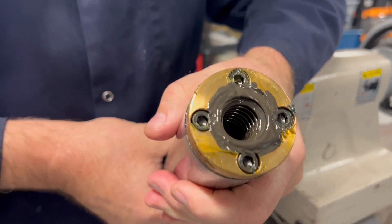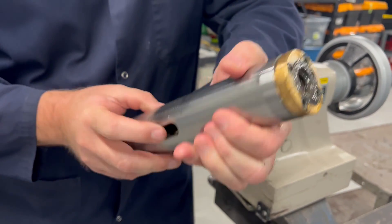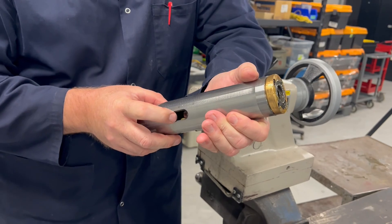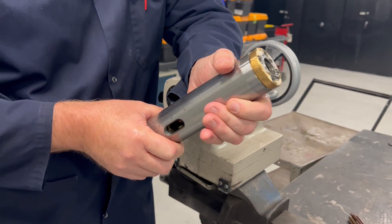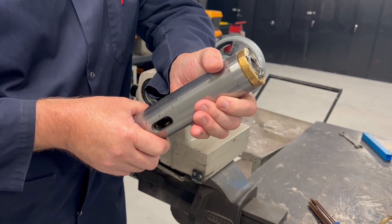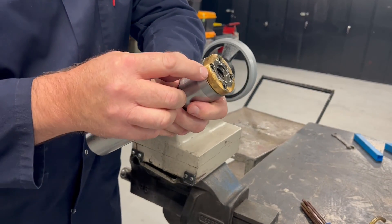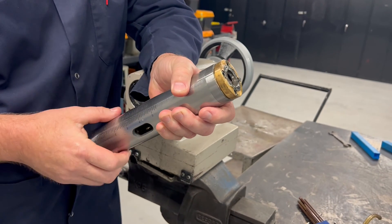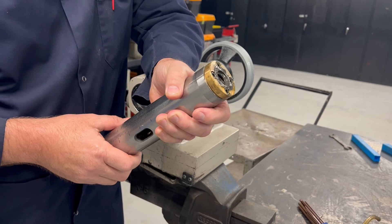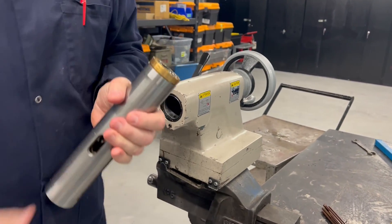There's the brass nut. I've got two theories on what's going on: either there are chips getting in through the knockout window, or it's under too much force when the thread is partway through the nut, putting a slight distortion on the threads. Either way, chasing it with a tap is what fixes this, so I'm going to go over to the vise and set this up.